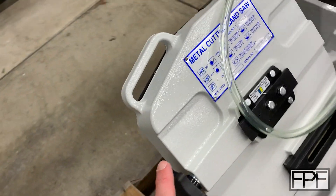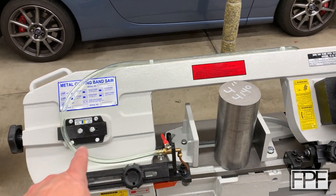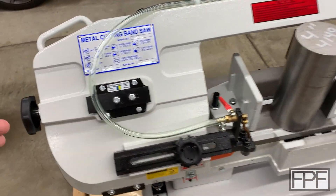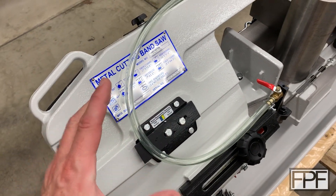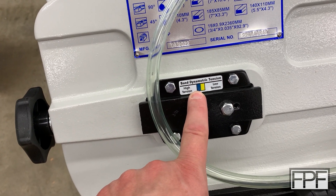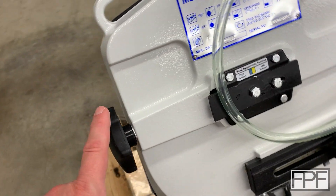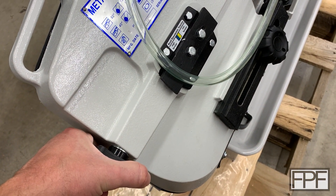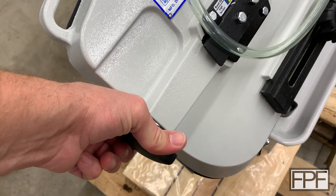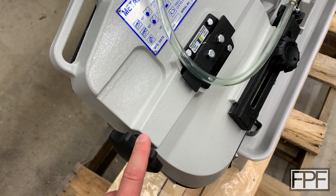The reason this machine is in today's video is because of this knob right here — this is what sets the tension on the saw blade. This saw has a cast iron wheel here, a cast iron wheel over there driven by this motor and gearbox, and the saw blade is continuous, running all the way around in a circle. By turning this knob it draws this block this way, basically stretching out the blade. There's a certain amount of tension you want on the blade to get a nice straight cut. They ship it with the indicator halfway between blue and yellow, and you're supposed to bring it over centered in the high tension box before using it. I actually thought this knob was stuck at first because I couldn't really tighten it with one hand at all.